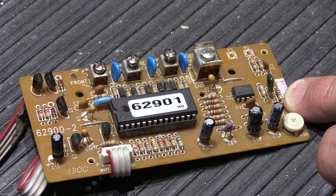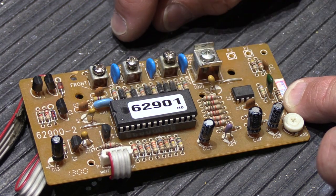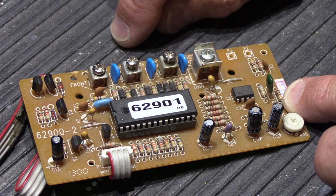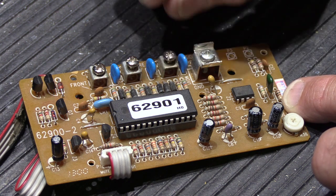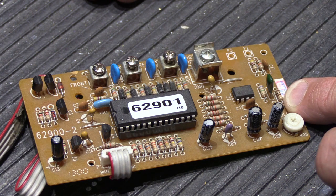That's the ins and outs of why you cannot connect a Ring video doorbell to the wires on your front porch if you have a Nutone intercom system with a chime module or a Nutone electronic musical chime — you simply cannot have both devices wired together. If you really want a Ring video doorbell, I recommend buying the standard one with the built-in rechargeable battery. As I understand it the battery lasts about a year with normal use, and when it's time to recharge, it notifies you — you just plug in a USB cable for a few hours.